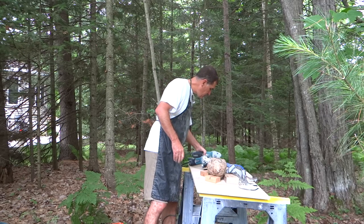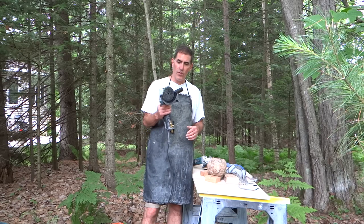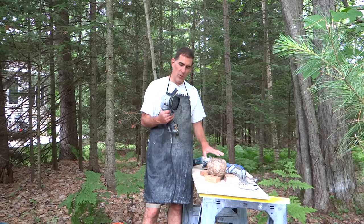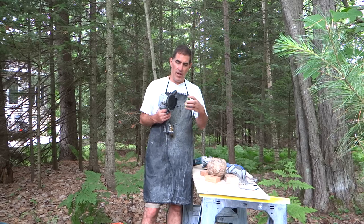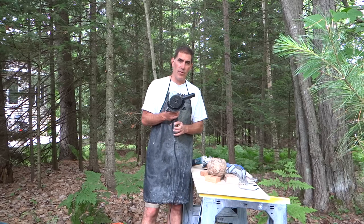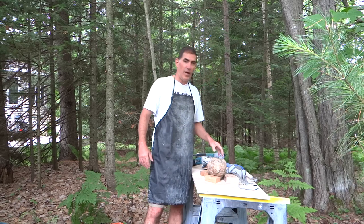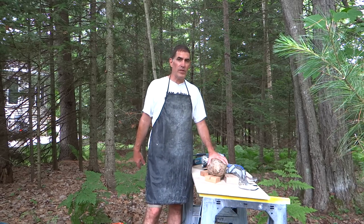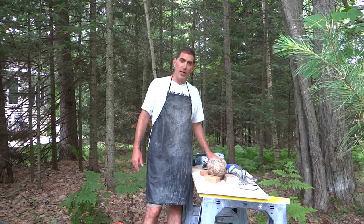And then I'll move on to this grinder, which is a wet grinder. So I hook this up to a garden hose. Water squirts out the middle and keeps the work wet. And this has Velcro pads on it. So I'll start with 30 grit and I'll work my way up through 7 or 8 different polishing pads up to 3000 grit. And I'll put a list of the different polishing steps I use. I'm sure there's other ways to do it, but I'll leave a list of those in the description. So let's get started.